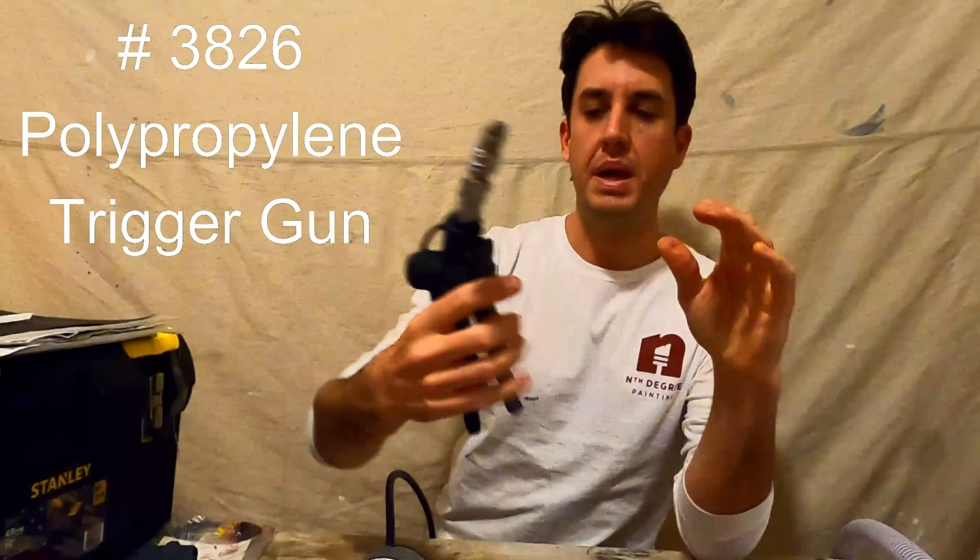I've been running 50 feet of tube. It could go a little longer most likely. I felt like 50 was reasonable to ask this pump to push chemical through. If you were going to try to do 100 or 150 feet, this might be a little underpowered, but that's just a hunch. One thing I implore you to do if you build this system is grab hose clamps and make sure things get nice and tight. Because when I was playing with this thing with water when I first built it, so much back pressure — this thing popped off. Because when you are not spraying, the pump is still applying some pressure. Imagine if you had stripper or brightener or acid — something caustic in here. You do not want that. So just really ratchet those clamps down.